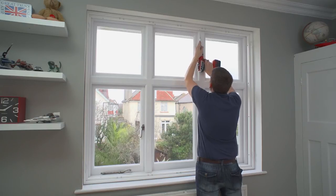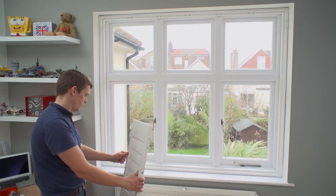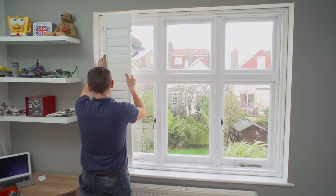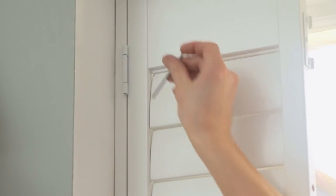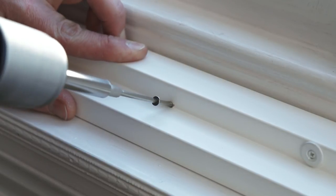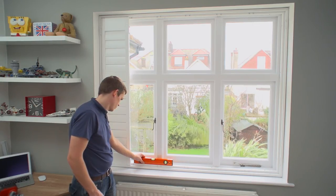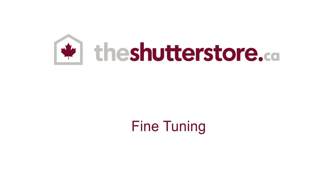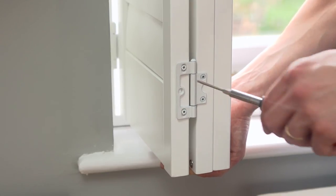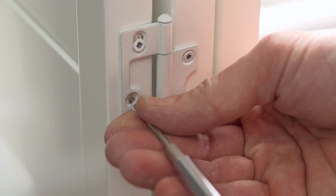Now we are going to hang the panel in the frame. If you look at the frame, you'll see the other half of your hinge is attached to the panel. Lift the panel up to your frame so that the hinges marry together, lift the hinge pin, marry the two sections of hinge, and then drop the pin to link the hinges. With the panel in the frame, insert the remaining screws and use your spirit level again to check that the frame is level and square. If you need to fine-tune the position, you can move the panels up and down. Once happy with the final position, insert the locking screw in the round hole on the hinge.